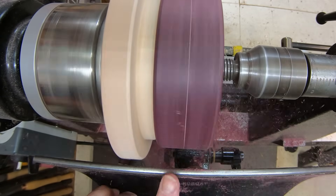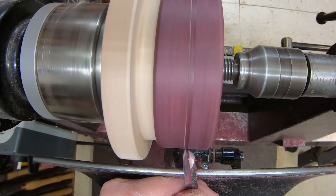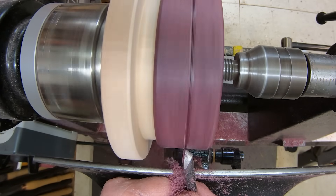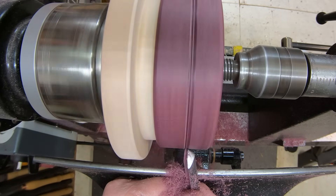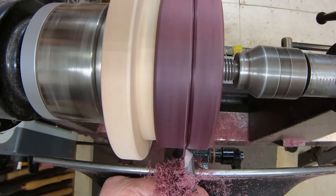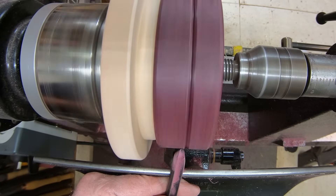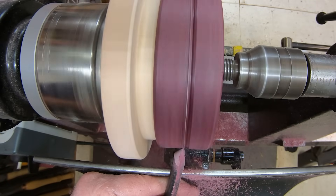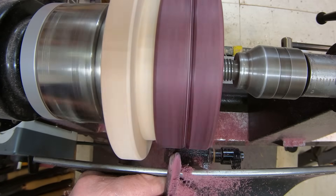Now here's the tricky one. See the white line? That's the intersection. So I'm going to come in here and start making a bead. I could do this with a spindle gouge, but I've got the bowl gouge in my hand so I'm going to try it with this one. I'm rolling, lifting the handle, letting the tool feed. Now I'm almost at a stop point with the way I've got this positioned — that rounded that edge nicely. One out of two, so we'll just round this one off. You can see the white line from the tape, so we want to make that our intersection.